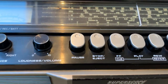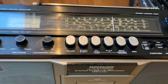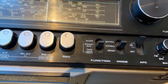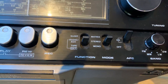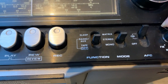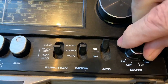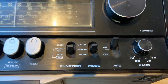And there we go - tune in something like that and there we go. That's fixed that problem without even touching anything apart from the knob itself - that's the simplest easiest fix you'll ever get on one of these old radios. The next stage is to do the same with the radio itself. We're now on FM, just turning this up slightly to get some signal - okay, FM works. Then we go to medium wave - nothing, crackle. We've got a little bit coming through. More crackle on short wave. What we want to do again is just do the same, turn the volume down and keep turning and wiggling to free up the contacts - not very scientific at all but hopefully a start.